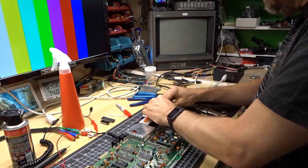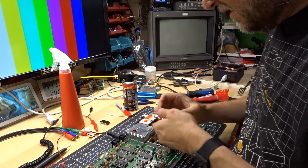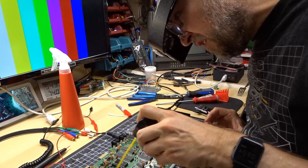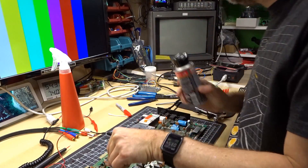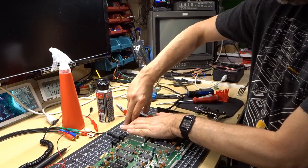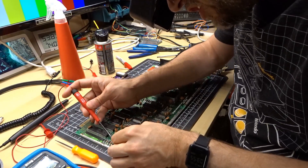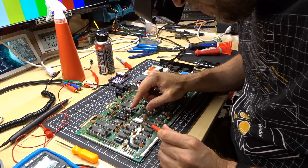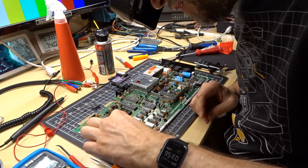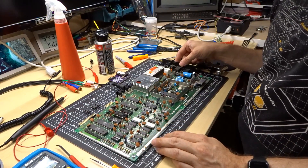Back to this machine — how strange that we're getting that weird screen. I'm going to put the known good VIC back in with a little DeOxit, all the pins are fine. And put the kernel ROM back in with some DeOxit as well. Turning this back on — still getting that flashing and weird colors. If I pull out the diagnostic cartridge it just goes to a brown screen. Let's pop out the other chips that are socketed — the 74LS257s in the white sockets and the 7406 — just to check. With those out, we get a black screen.